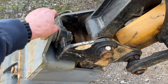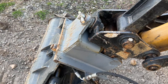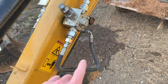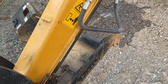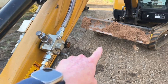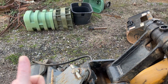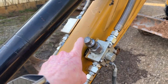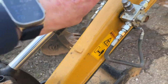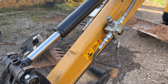One thing I like about this - it's real easy to swap out. You put just a little bit of pressure, especially after you've got it worn in a little bit, attachments come on and off. So what I was referencing before about making it easy: we've got our thumb all the way up. When we flip these around, that's going to keep the thumb up, but I can go back in and turn the ignition key to on - don't crank the tractor - move the control both left and right, and that'll release the pressure on these and make it a lot easier to get this tilt bucket connected up to the hydraulic connections. I've got one there going this direction, one on the back side. If you've ever wrestled these before, they're tough.